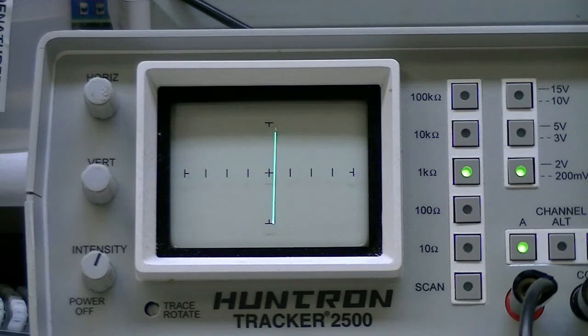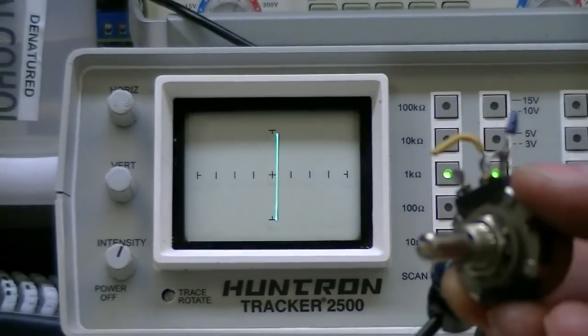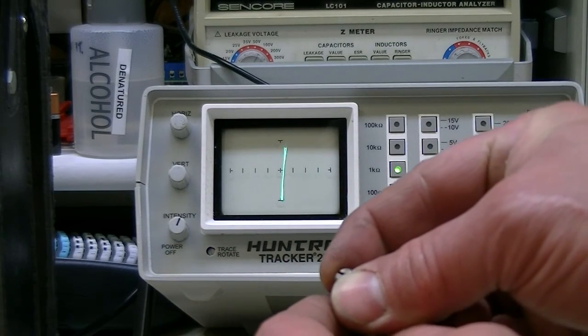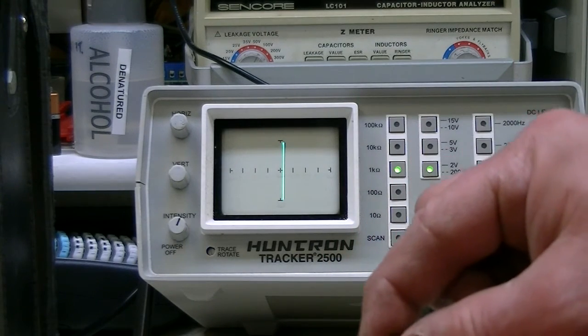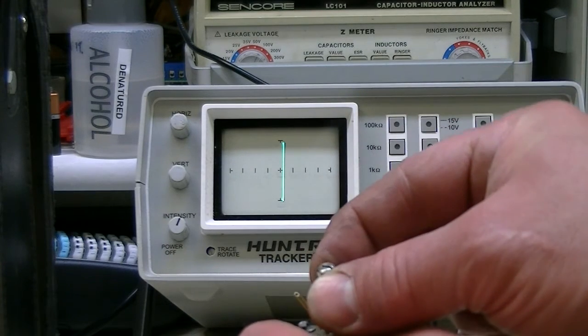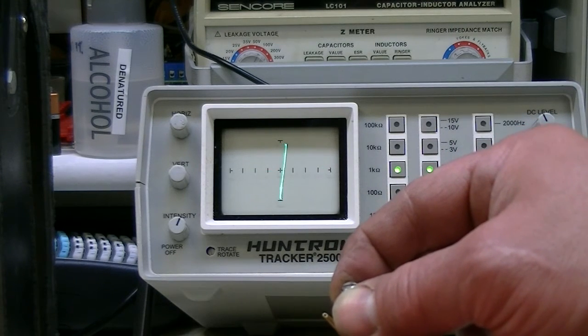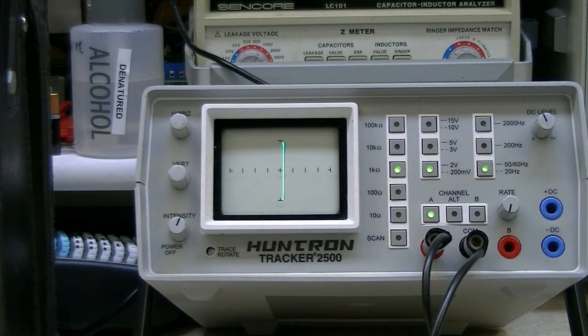Basically, if you — see how big the jump is? I'm just barely turning this. Let me back this up so you can see how little I'm actually rotating it. Very little, and it flat lines almost immediately. And that's what was happening — that thing would flat line like that and go to maximum amperage, and it'll blow a hole right through the bottom of the copper slab.